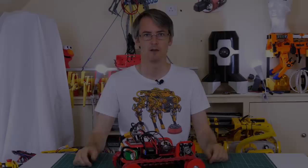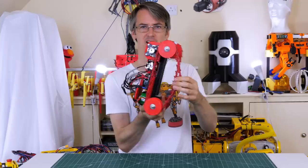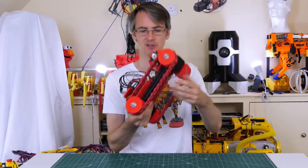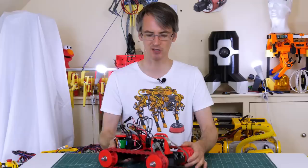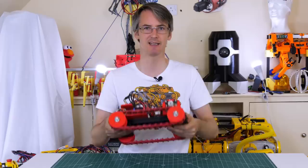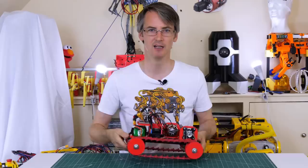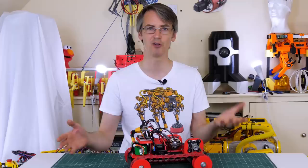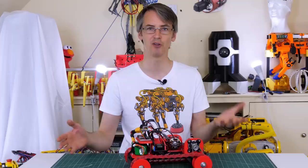That went pretty well — I'm pretty happy with that. The tracks do come off sometimes and pop back on when driving straight, because the NinjaFlex is quite stretchy. It might be worth trying a slightly more rigid flexible material like NinjaFlex Cheetah or another TPU that's less stretchy but still flexible, so the tracks don't stretch onto the larger part of the wheel. Other than that it's pretty good — the tracks grip well and are great at climbing over things, and it steers fine on a smooth floor. The obvious problem with tanks is that too-grippy surfaces cause more friction, but not an issue with these giant motors. Next time I'll be doing something more intelligent — navigation using vision recognition, probably with a Jetson Nano. All the CAD and code are published and free via the link in the description; Patreon and channel membership links are there too. Thanks again to Brilliant for sponsoring.